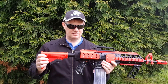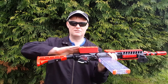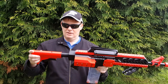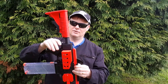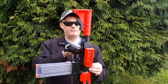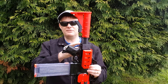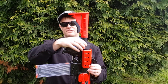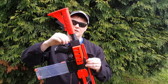I actually printed the battery case a couple of times. I ended up printing it like this because that meant all three sides came out perfect, but it used a lot of infill. For the stock at the back: print this end like this. There's a slot on the new one that's 45 degrees up here, so you just print from the bed upward to support it, which will fill in the bottom, and the rest prints fine because of the 45-degree overhang.